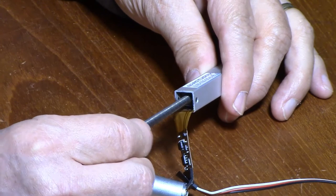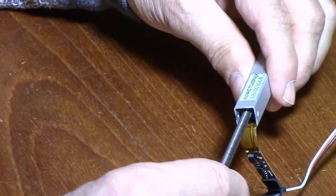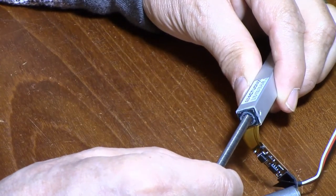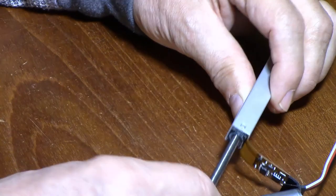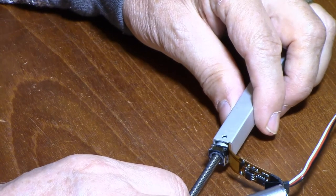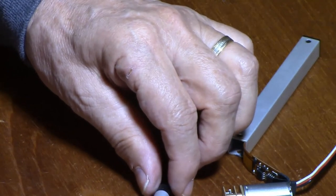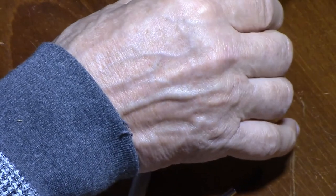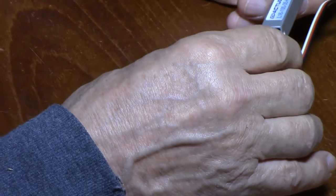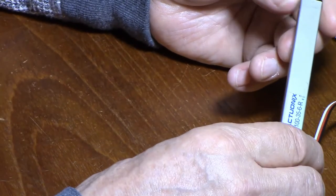I could do with a little torch or something. I think that the potentiometer is on this strip here. Yes. And that thing is rubbing up and down on... Is that just a short circuit across... What have we got on there? That's just a contact, isn't it? Yes. And it looks like a sort of graphite surface. Okay, so it's a long linear potentiometer. Yeah, that's right. Consisting of a strip of pencil lead. Yeah. And the lead screw...